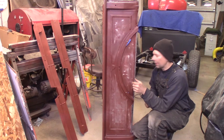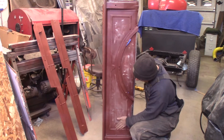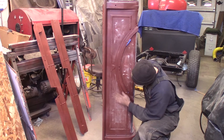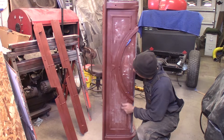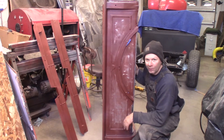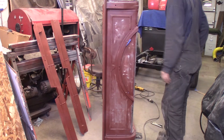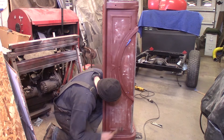The parts are ground down and the primer is drying on the front of my frame. I went ahead and sanded the primer lightly — blocking in the box here — and all the high spots are showing up, all the spots that need to be hammered down. The dents are dense here, the whole thing is kind of waffly. I'm just going to take the hammer and dolly and smooth these out a little bit.